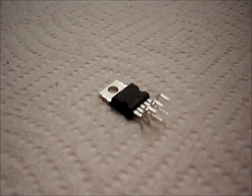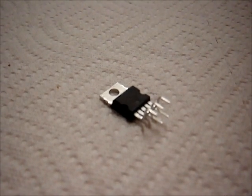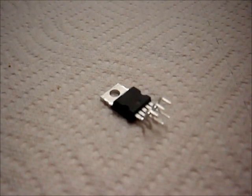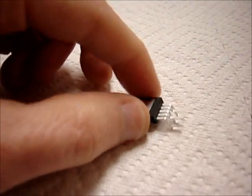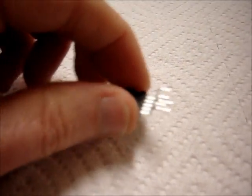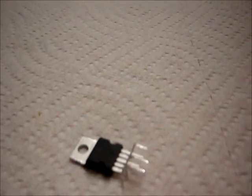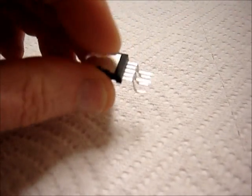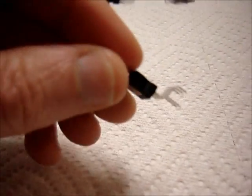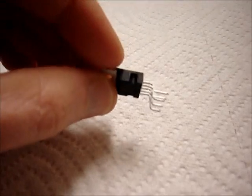When you do it right you can make a really nice little amplifier. You can get about 25 watts of clean power maximum with these. I don't recommend pushing them any harder. They are in a small tiny package and have to dissipate a lot of heat. Like all the other amplifiers I talked about, they all have built-in circuit protections, but still you don't want to push them beyond what they were made to handle.